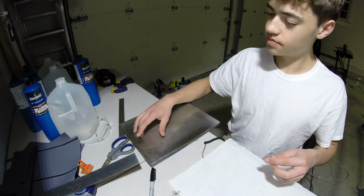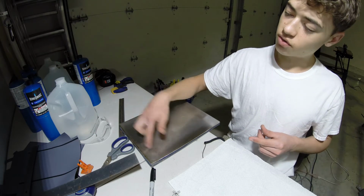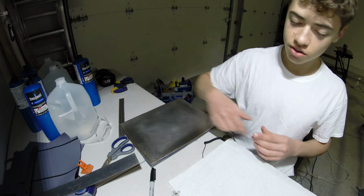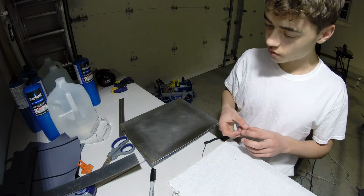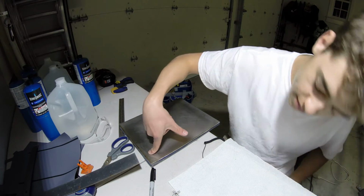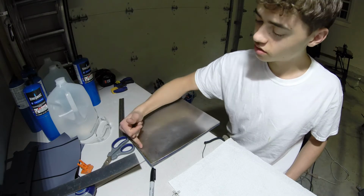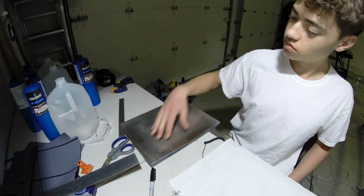I wouldn't do it for this one, because this is the top plate, but the neutral plates, I'll have to have holes, because the gas is going to rise up, so I gotta have them all connected. You gotta be careful about having them too close to the gasket, but then not having them close enough. Because if it's not close enough, it'll start building up. And you've got them down here. You got that much gas that has to go that way.